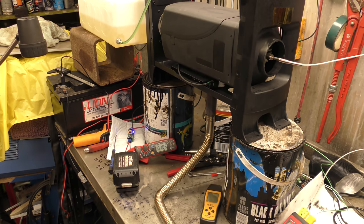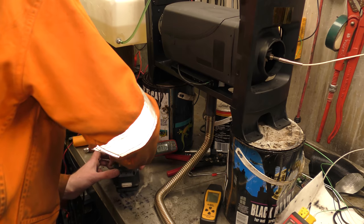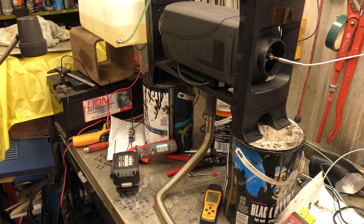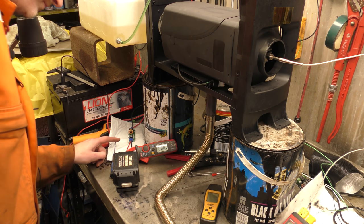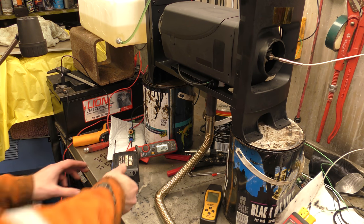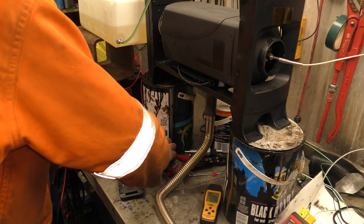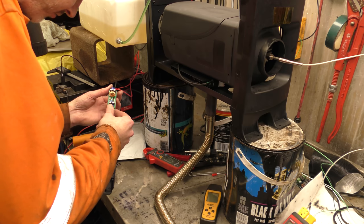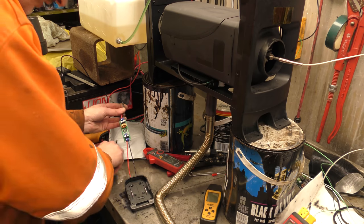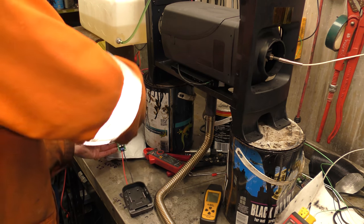So the 10-amp supply — or the converter module — didn't do the full 10 amps. The question is which bit failed. Did the battery fail? I wouldn't have thought so. We've let the smoke out — I saw a wisp of smoke there and it has died. There's a delightful aroma of melted circuitry. One of those little IC chips got really hot and smoked out. It did not last 10 amps — it did 7 amps briefly and then gave up. That fucker's hot.